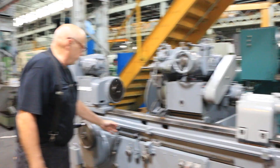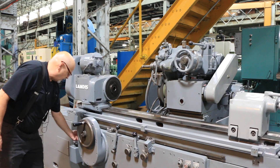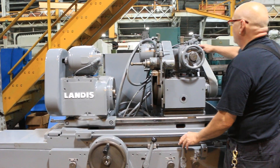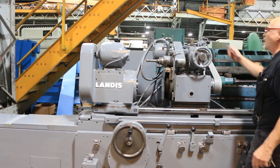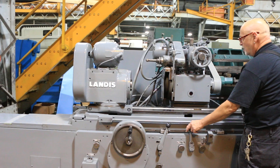Now we have our table going back and forth. Over here we have a selector dial to select the left side, right side, or both sides of our workpiece. When we hit the reversal stop, we feed with our hand wheel here. The amount that it feeds is adjustable with this thimble adjuster up here to get more or less feed.